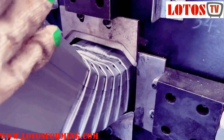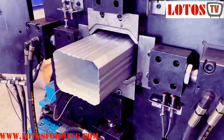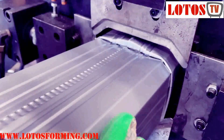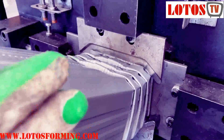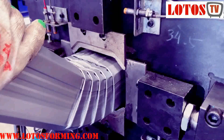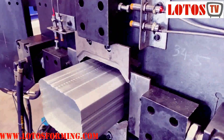The most important thing when doing this sort of bending is that the surface of the profile cannot be damaged, especially for the coating. Also, the clamping part must not loosen during bending. This is very important — how to make the die and set it in the program. This die unit is used for doing the bending.